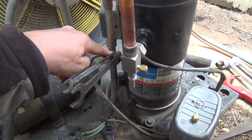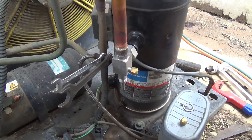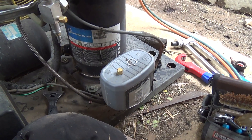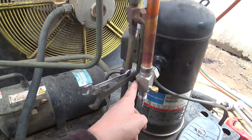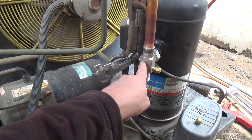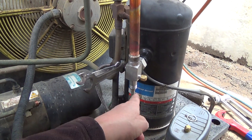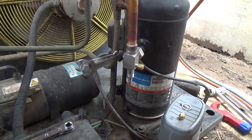These are 7/16ths or 11 millimetres, and these tend to be 9/16ths. Same on the pressure switches - sometimes you need to hold one of those. Some of them are 7/16ths and some are 12 millimetres; I think the Danfoss ones are 12 millimetres. Make sure you've got it on the right side - you want it on the side further away from the stem, because that's always open. Wind it all the way in, it's open to the pipe; wind it all the other way, it's open to the compressor and the pipe. You cannot shut that one off. If you put it on the wrong side, you can isolate the pressure switch by mistake, and then you also can't put your gauges on there.